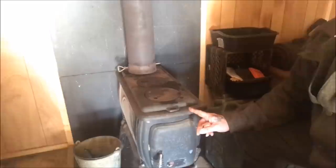If we open it up you'll see in the back it's really cooking good. The goal is to get this fire the full length of this stove - if the fire is only in the back, you're not efficiently heating this thermal mass heater. You really want that fire as long as the stove is. So when you're cutting your pieces for fuel wood, cut them the length of the inside of that stove if you can, because that'll give you better heat overall within the cabin area.